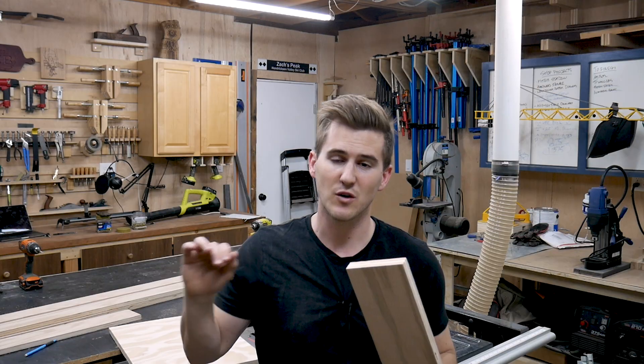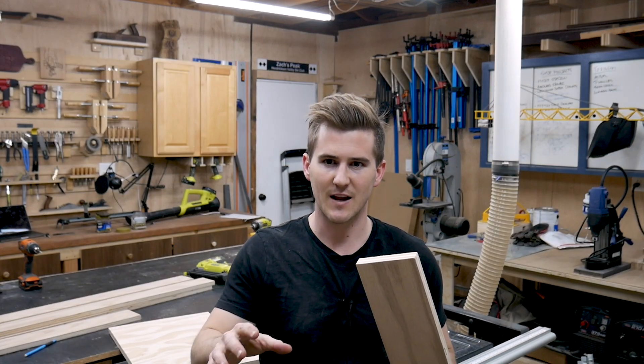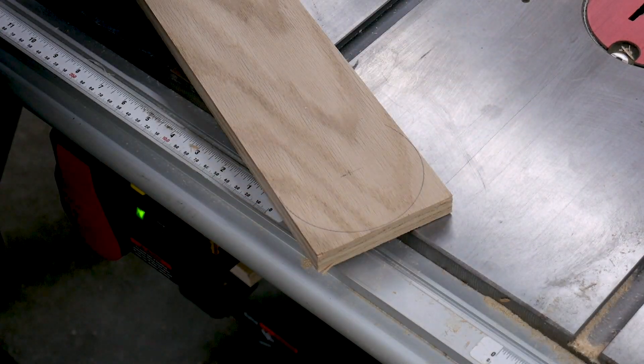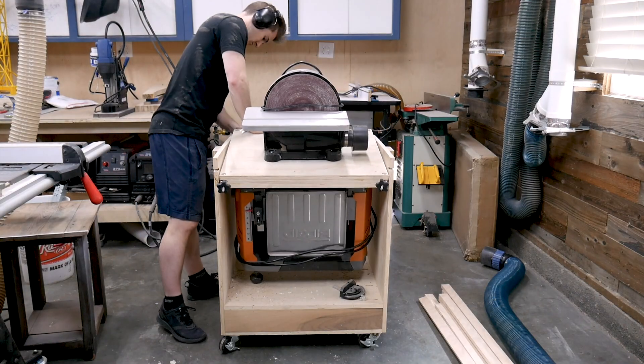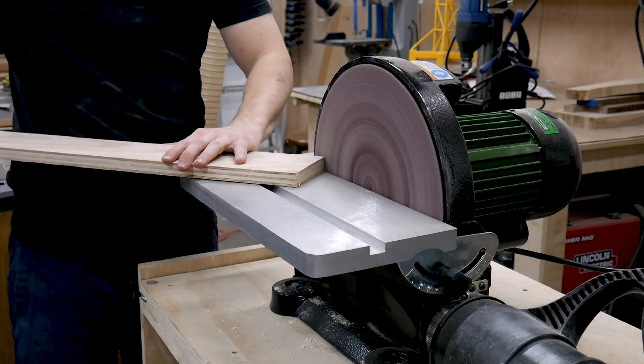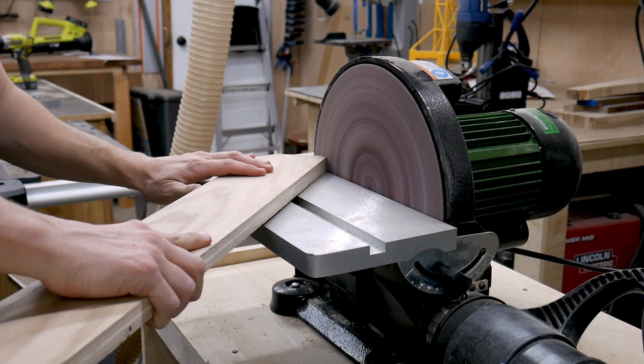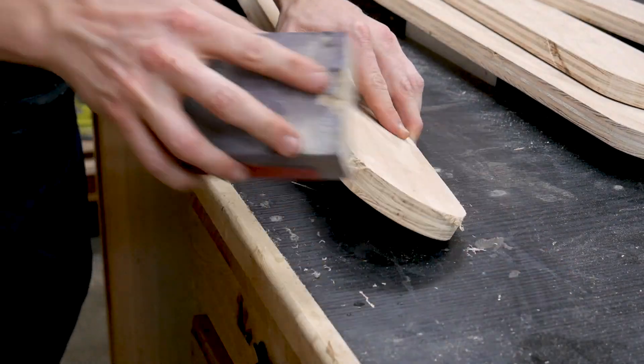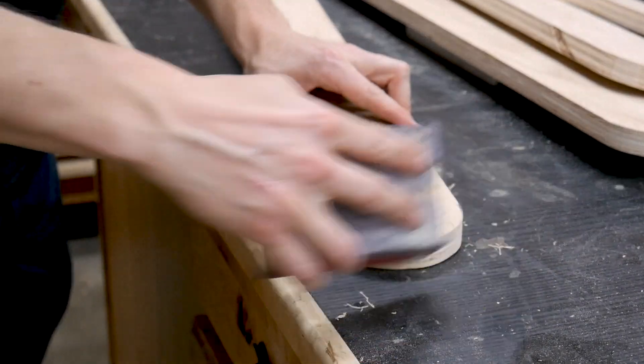I just finished breaking everything down at the miter saw. One element of the design is that wherever possible I wanted all of my end pieces to have a nice rounded semi-circle — aesthetically it looks nicer and it's a bit safer on my hands. Plywood can get sharp when cutting lots of 90-degree angles, and since my hands are going to be reaching forward a lot or this thing is going to be swinging around, I just wanted nice rounded corners. I'll use my protractor to draw the semi-circle and then head to the big disc sander to sand that material away. Everything is now sanded down to its final radius. The next thing I need to do to make this a sliding system is route out half-inch grooves in the pieces that will slide up and down — I'll do that at the router table.